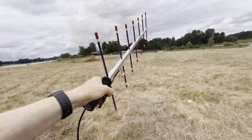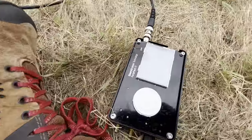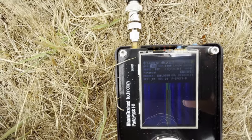That last satellite pass was a bit of a bust. There was some sort of increased noise floor that I couldn't really explain, and I'm suspecting the low noise amplifier was being saturated due to some sort of local interference. So I set up the Yagi antenna again, hooked it directly to the HackRF without the LNA, and used a firmware mode called Looking Glass to sweep frequencies from about 100 megahertz to a gigahertz to see what was in the direction of the satellite that might have been causing that interference. And I found a few things.